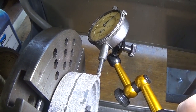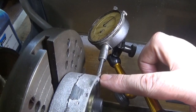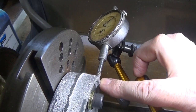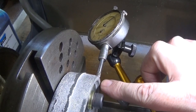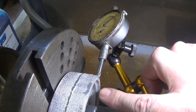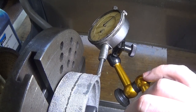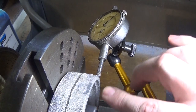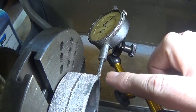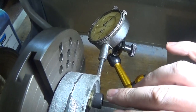Excuse the washing machine in the background. That's set up pretty good — a fairly simple setup. It's within about a thou on this side and this side, and within about a thou on the other sides too. Because it's a casting and because there are differences in the sand and stuff, it's not going to be perfect and smooth all the way around. There are bumps all around it that are probably 10 thou high. So I've set it up here and here and it's pretty close — not far out.